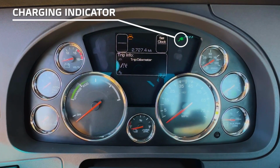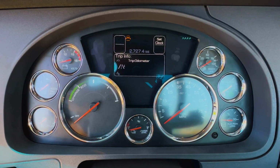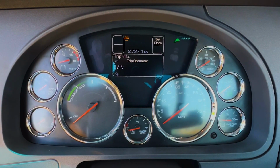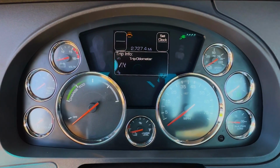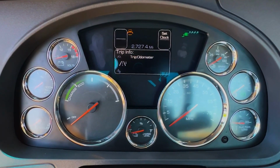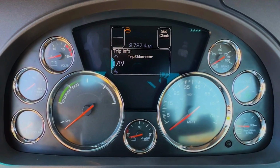When first plugging the charger into the vehicle, your charge rate will start slow and gradually climb to the peak rate over the course of a couple minutes. You should see the peak charge rate sustained until about the last 10% of charging. At this time, the charge rate will decrease to about 7 kilowatts.